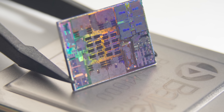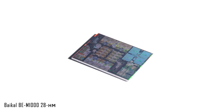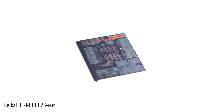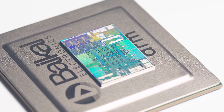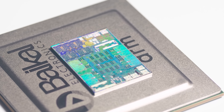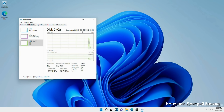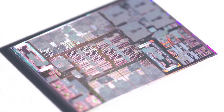Have you ever wondered what a Russian processor looks like inside? Are they any different from all the rest? In fact, no. The opening of the latest Baikal processor revealed 2 billion transistors at 28 nm. This ARM chip has two 4-core clusters, Mali graphics, and is manufactured at TSMC — so there are obviously few internal differences from other ARM chips, and the structure is really similar to the Exynos picture above. Based on the Baikal, simple but by no means cheap PCs are already being produced and sold. Most interestingly, after manipulating the BIOS it is possible to run Windows 11 on them — most drivers could not be found, but the system is quite snappy, so the future of Russian CPUs includes not only Linux but also ordinary Windows.